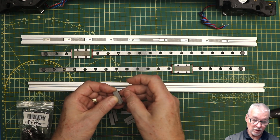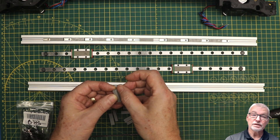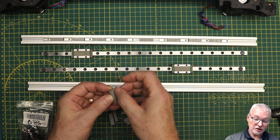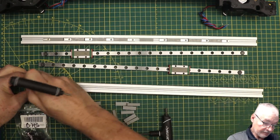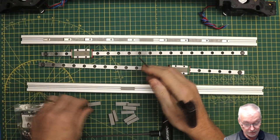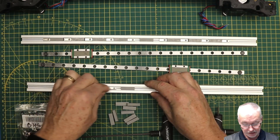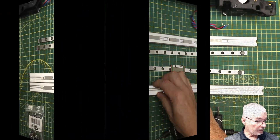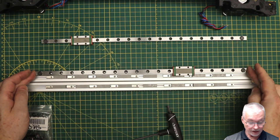What I found worked was 0.15 millimeter layer height and a first layer of 0.2 - that way you can get the 0.5mm dimension precisely, and you just need to make sure your printer is dialed in. It's a tight fit; there's no point putting them in if they're going to be moving around. Now I'll get all the M3s rolled in and lined up.